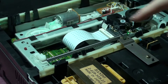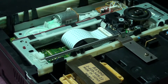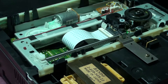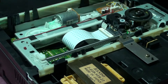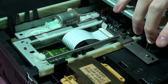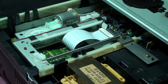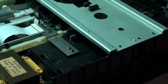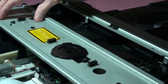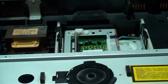I'm not going to worry about lubrication yet - I do have some, but I'll worry about that in a minute. The main thing is whether it can just read a disc for now. I'll put the clamping component in here, line it up with the little plastic lugs on both ends - give a little whack and it's locked in. I don't think I'll worry about screwing anything else down. New laser is in.